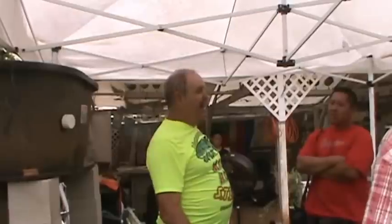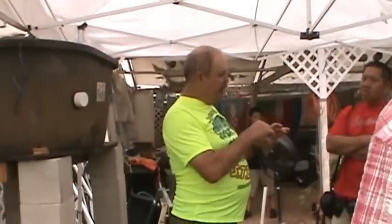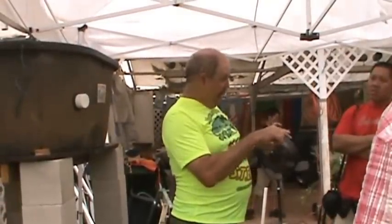2 pounds per square inch. That thus will only pump 4 feet deep at the rated volume. If you go down 5 feet, you get a lot less. Go down 6 feet, you get nothing. So you come back up to 4 feet, and on the side of the pump, it says 1.85 PSI, and it says 45 liters per minute. You go deeper than that, you get a lot less. Now, if you come up close to the surface, you get more. You know, you get lots of bubbles, but you're not pumping anything.